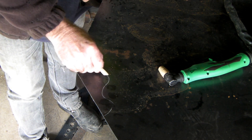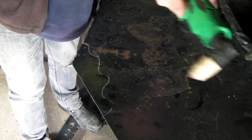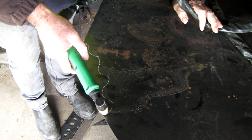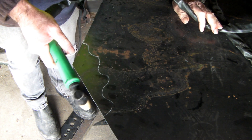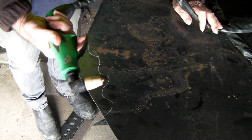These are just designed to hack and cut through your steel. So if you want to cut a squiggly line along here, you grab your torch — only talking 3mm plate — and away you go. I'm cutting from the edge, so that's not a problem. I'll put a link up top explaining why you always have to cut from an edge.